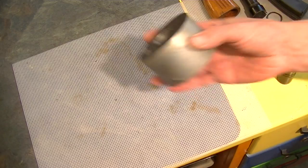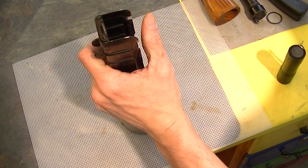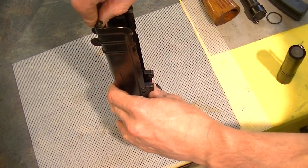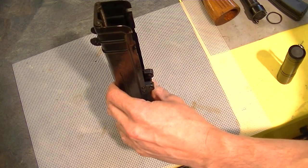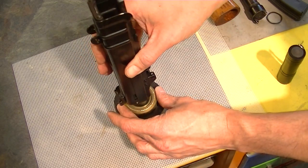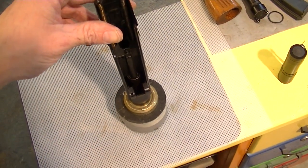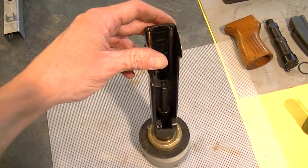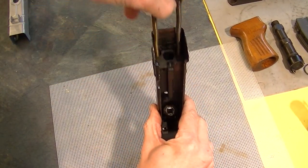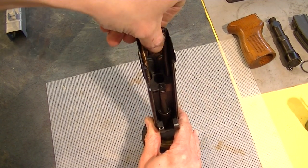And if you really want to get slick with it, you can get your standoff here and get the most out of each one of your taps. That block is aluminum and this is a piece of brass, and so by doing this we've got something more solid and substantial. And we're really going to see that barrel get driven a good bit better.